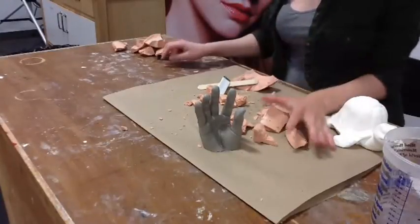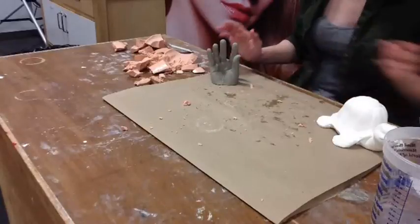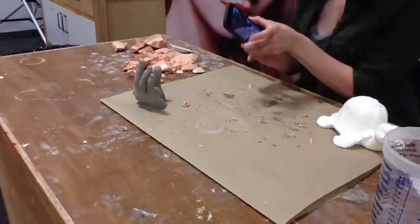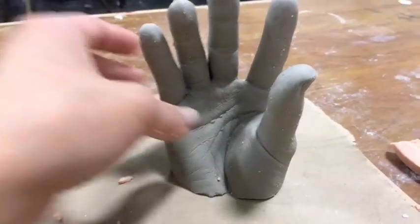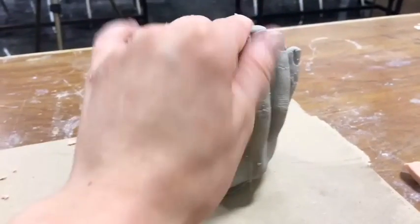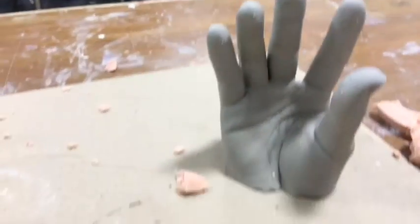The Ultra Cal did capture a lot of detail, which I'm super happy about. Just always remember: be rough with your alginate and gentle with your actual casting. And there we go — here's my creepy tiny little hand! Let's get a close-up so you can see all the little details. There are some little spots where we've got some little nubs, but those can easily be taken away and once we clean this thing up it's going to be a lot nicer. That is our fun little finished product. Thank you guys for watching, and as always, if you have any videos you'd like to see, please comment and let us know and we'll do it next week. See you later!